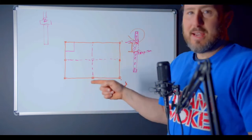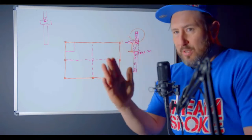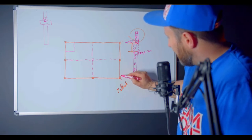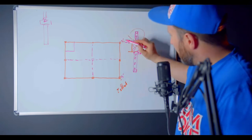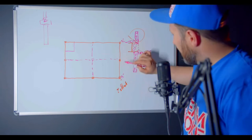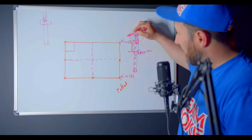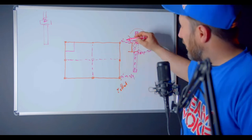You check both ends, and usually it's going to be sticking out in places like in the middle a little bit or something, so that's when you just bring your line out. But you want to make sure you're snapping lines the same distance. So say you're a half inch out on this side, okay, you want to be a half inch out on this side, and you snap your line, and hopefully you're half inch out from the middle as well, but you check. If you have to adjust and bring it out, make sure you bring it out the same number. So if you got to come out 3/4 on this end, come out 3/4 on the other, and so on and so on. Always come out the same on both ends, okay?